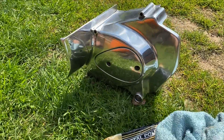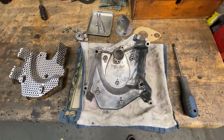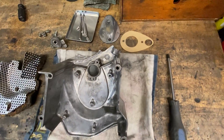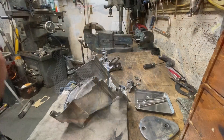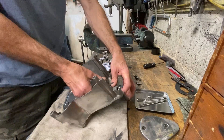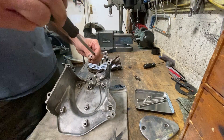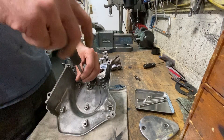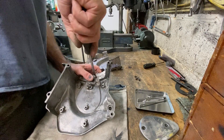With the polishing complete, it was time to go back in the garage and assemble the sprocket cover with all its parts — the clutch operating mechanism, the sound deadening mechanism and the gasket and cover. The first thing to go into the sprocket casing is the clutch operating mechanism, held in place with two screws. Once the screws are tight, the next thing I fitted was the sound deadening material and its metal gauze cover, held in with five screws.